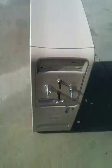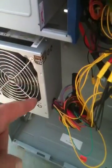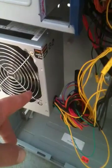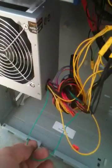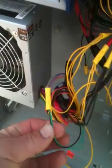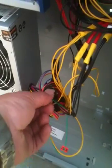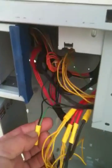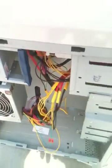One other thing of note: you've got to look at the power board inside by taking the cover off your power supply, and it'll tell you on the pinout that one of them is PON for power on — that's a green wire in most cases. That has to be connected to a black wire too, which I did here. That tricks the PC power supply into thinking it's connected to a motherboard. Green wire to one black — doesn't matter which black, any black.